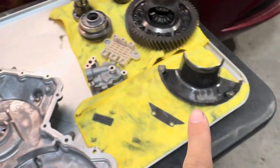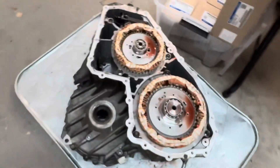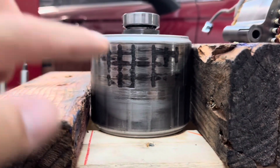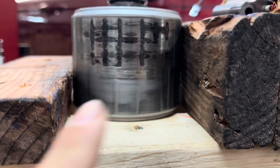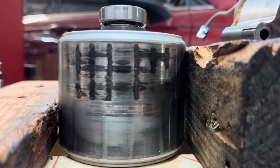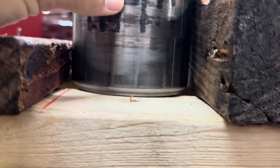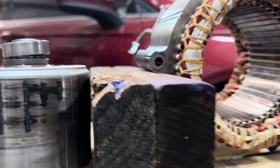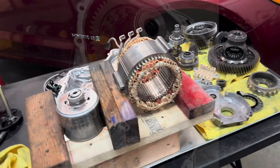The magnet had a lot of metal on it and we got a lot of metal out of this transmission. Stay tuned — I'll get it all together and show you what that bearing looks like once I press it. Got a little bit more of it apart now. Let me show you what the stator looks like pulled out — this is all burned up because it seized itself to the inside of the winding. Do you see all that mess in there? These grind into each other and this one's no good. Can't reuse it — this one's really bad, had some serious electricity going through there. You can see the bearing is just collapsed. New stator — I've got it on my jig here and we'll continue working on it.